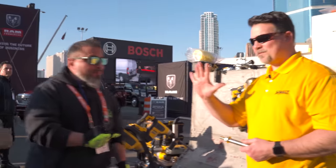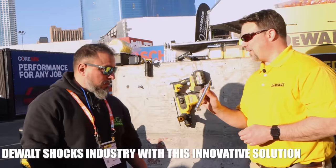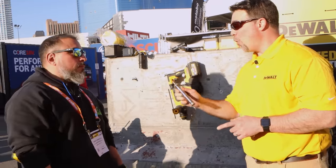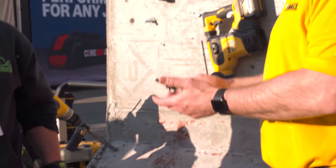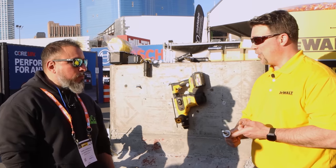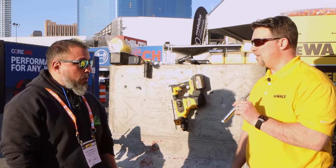This is Chris. You're gonna love this. Tell us all about it, my friend. CCU Plus Anchor stands for Critical Connection Undercut Anchor. Critical connection, why? Infrastructure, bridges, tunnels, critical connections. So these are rated. It's approved for cracked concrete, it's approved for seismic. It's the strongest mechanical anchor you can buy.